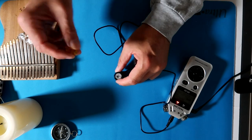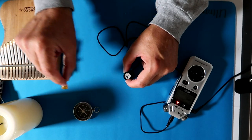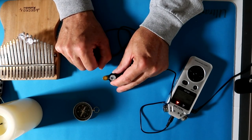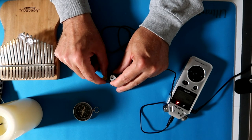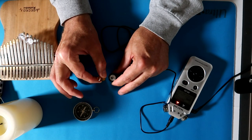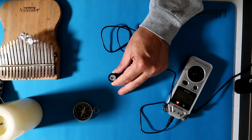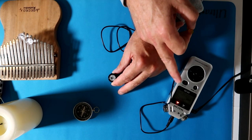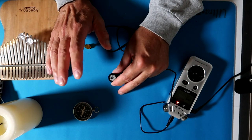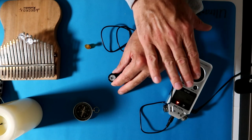And so that's why if I have a magnet here, and I've got my other magnetic detector over here, if I just put the magnet by the field coil, you don't hear anything, all right? There's no change. And the other thing is that if I could sort of linearly bring the magnet in and make the field increase smoothly, or decrease smoothly, just like that, you still don't hear anything. It's making a current, and that's going into the field recorder, but it's basically a flat signal, so super low frequency, zero frequency signal that probably isn't even recorded, or it's rejected by the recorder.